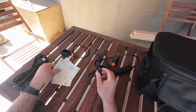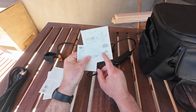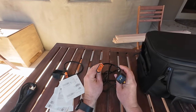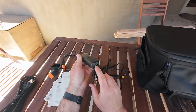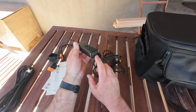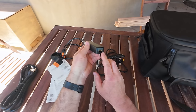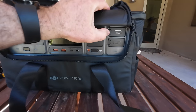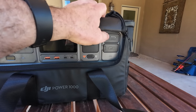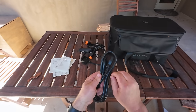Regarding solar charging — DJI shows an extra adapter in the instruction manual. If you have a solar panel under 24 volts, you could plug it into the SDC slot via the lighter adapter and charge that way. I noticed the SDC ports are labeled differently: the top one is standard and the bottom one says 'light,' so one is probably a higher output/input and the other lower.